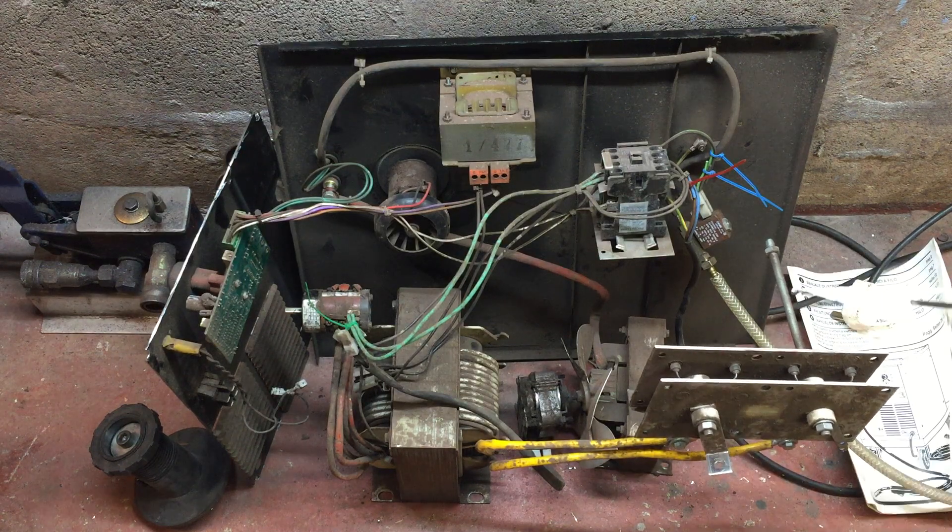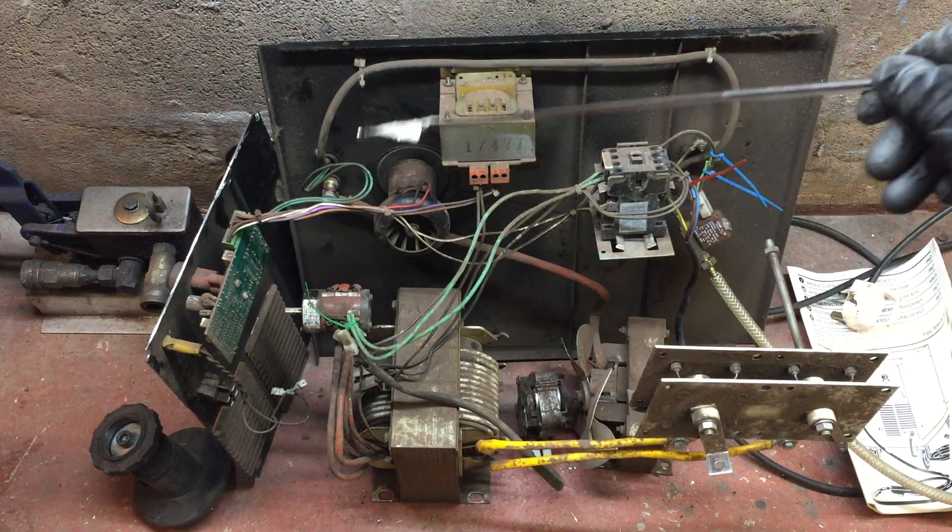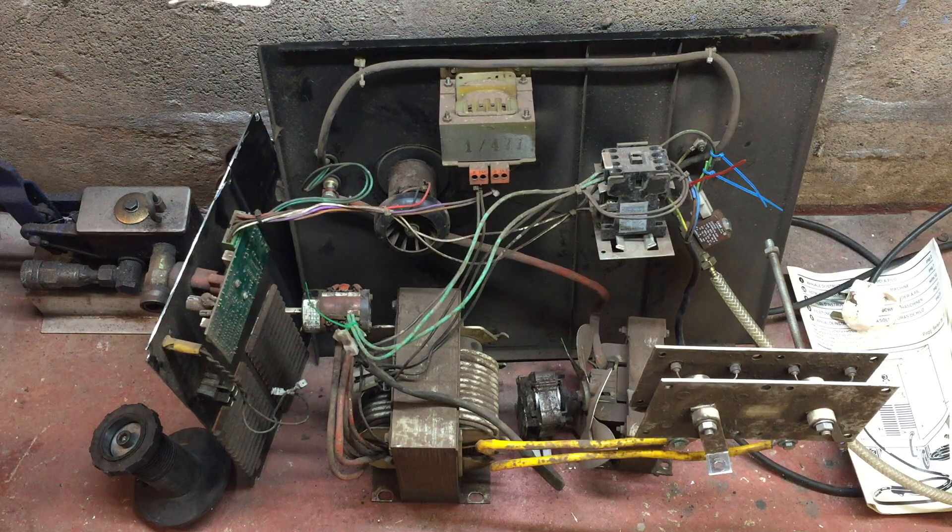You can see there are rows of diodes in here. The output is at this plate and that plate — I think this plate goes to the lance and that one goes to the ground cable, the one with the clamp on it. These diodes are taking an AC input on these two yellow wires, turning it into DC. The DC goes out through this wire, out to the lance, and out to the 0.8mm wire that I run.